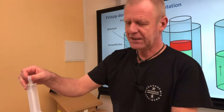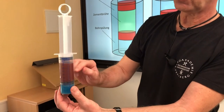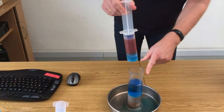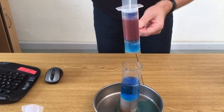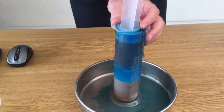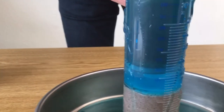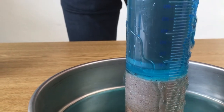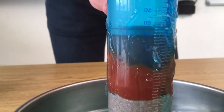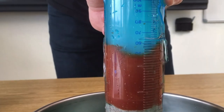Now let's try to recreate this process with a little experiment. Here we have a syringe, which is a casing, a red portion which is the cement, and the blue portion which represents the drilling mud in the hole. So we begin the process slowly. Now we can see how the lower plug is moving downwards gradually, gently. And when the lower plug gets to the bottom, the membrane breaks and the ketchup, which is the cement, rises upward from the bottom and spreads evenly around the space between the pipes.